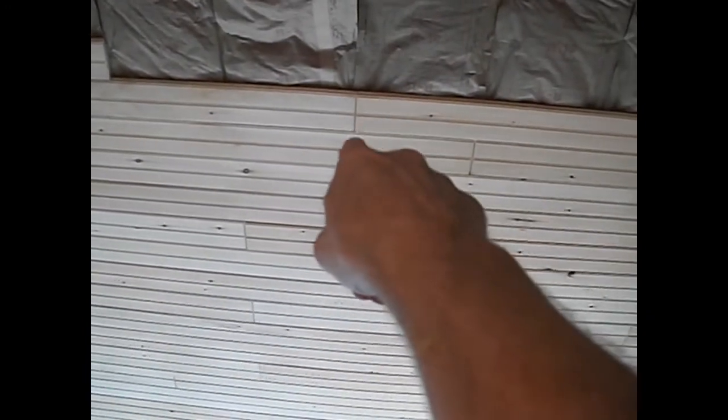And we're going to have to do our ripped bevels here pretty soon. But I have a little problem with an undulation right on that joint right there. It's just too much of a bend right here. I can't get that board down over it by myself. So that's going to wait until I have help, and then probably an hour we'll have the last courses and be all the way up to collar ties.